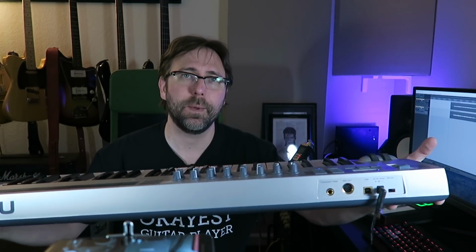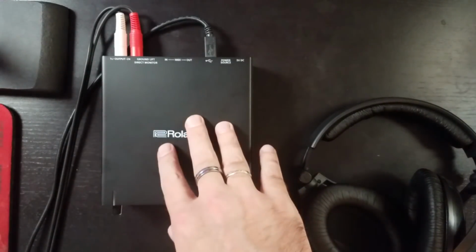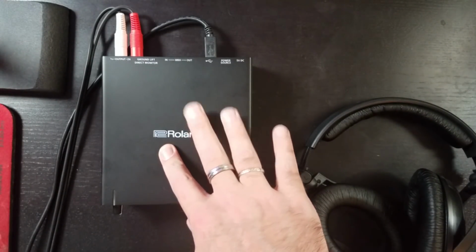It's a big 49 key thing. Let me see if I can get it set up here. It has 5-pin MIDI on the back of it. I'll plug into here, and we'll just see what the response is like from it. All right, just out of frame here, I got the old Xboard 49 out. On the back, I'm not sure if you can make it out from there, but yeah, it's got a 5-pin, but only a MIDI output. There's no MIDI input into the keyboard, so I'm only gonna be able to test the MIDI input into the Roland and not the MIDI out.